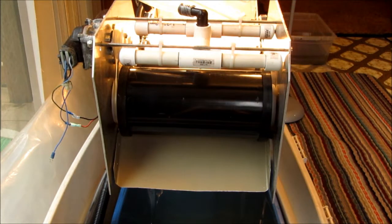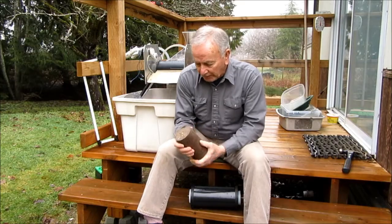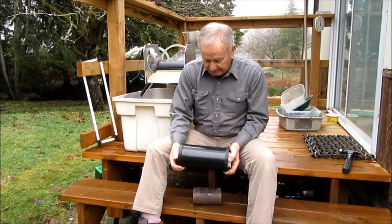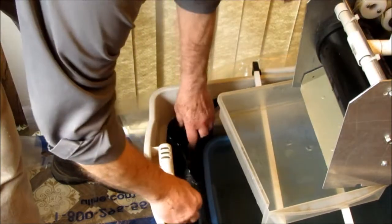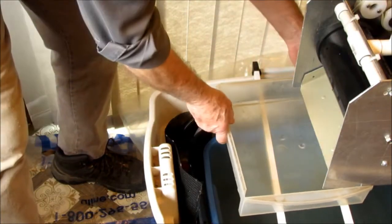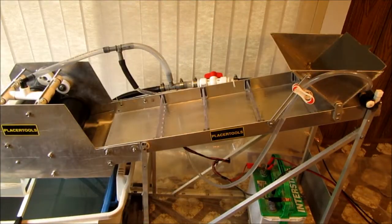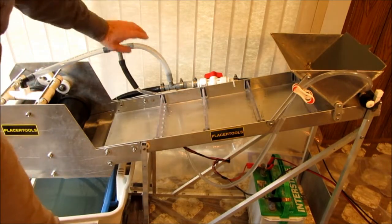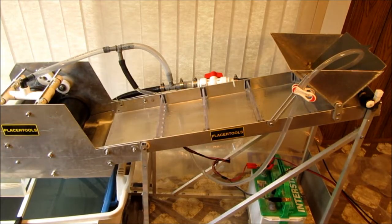You can catch the magnetic material into a separate container. To demonstrate the magnet strength, I have a solid 15-pound steel weight and one of my drums — as you can see, no problem. The water delivery system is an 800-gallon Rule pump, and I've made a screen for it just to keep organics from plugging up the jets on the spray bars. The rest of the components consist of a 12-volt drive motor, a pulley system, a control valve, and a splitter that gives you a small working hose to help with processing. And of course, a battery.